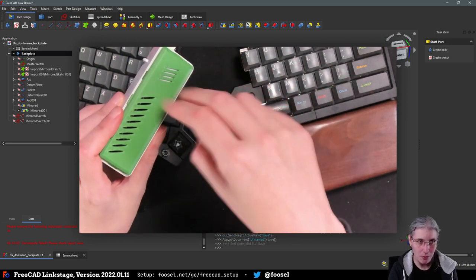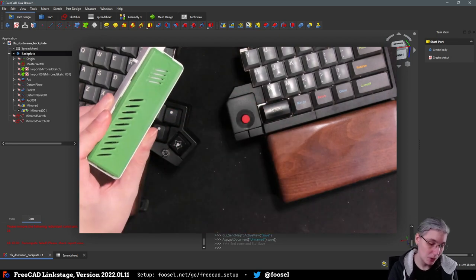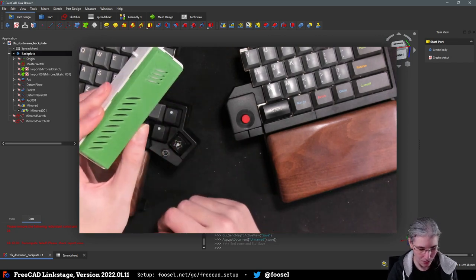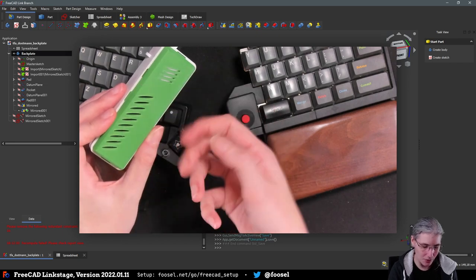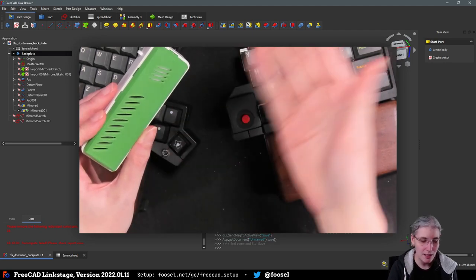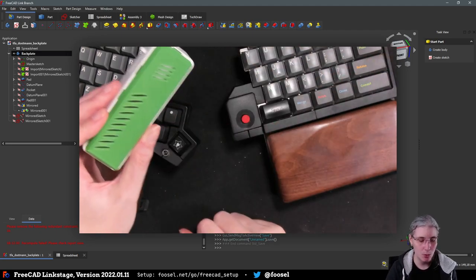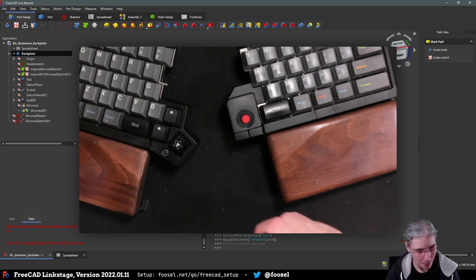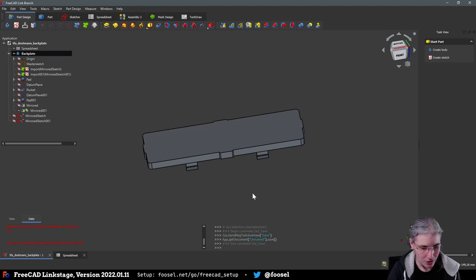the ESP is inside the enclosure with the sensor. The sensor is heat sensitive, so the ESP is currently confusing the sensor slightly, and I want to have this better. So the idea is to put the ESP on the outside. It will still be in an enclosed compartment, but there will be a physical separation plane between both. And yeah, so that is the idea. And we just finished, don't fall, please, we just finished with pretty much replicating this, and now I will build up from that. At least that is the idea.